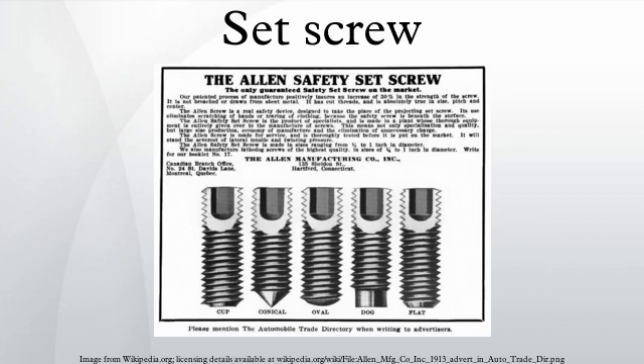Splines offer yet more strength. For longer life, set screws are usually made of alloy steel and case-hardened. Hardened set screws often leave a plastic deformation, in the form of a circular or semi-circular mark, in the shaft that the screw sets against.